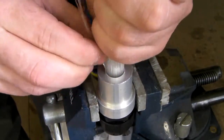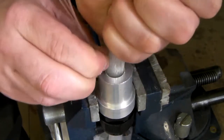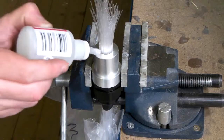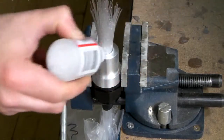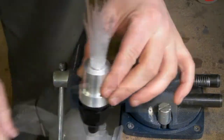You will find that sometimes this can be quite tight. Twisting the common end within the ferrule can help straighten the fibres out and ensure you can fit more in. Once the ferrule is tightly packed, we apply superglue around the outside of the fibres in order to ensure a firm hold. After this is done, please ensure that the common end is held upside down while the glue dries.